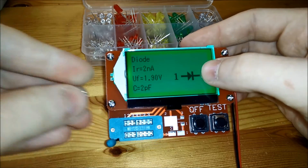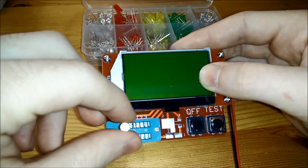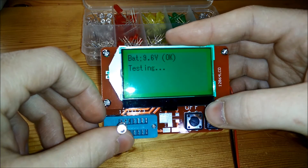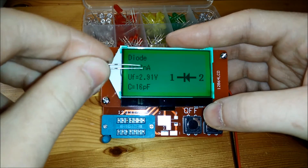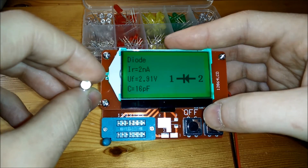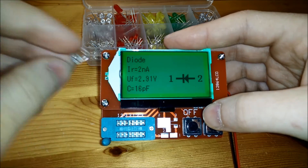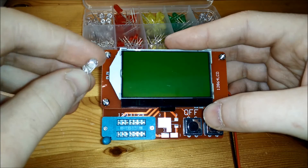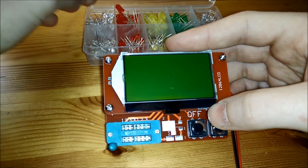Now testing what I think is a blue LED, but it could be white. It looks like there's phosphor in it so it's probably white. Forward voltage should be about 3 volts — and it reads 2.91 volts. That's the voltage just to get current through it; if you push 20 milliamps through it as you usually do with 5mm LEDs, you'd see around 3.2 volts. Chinese LEDs tend to have a slightly high forward voltage because they're lower quality, but they're good enough for most projects.